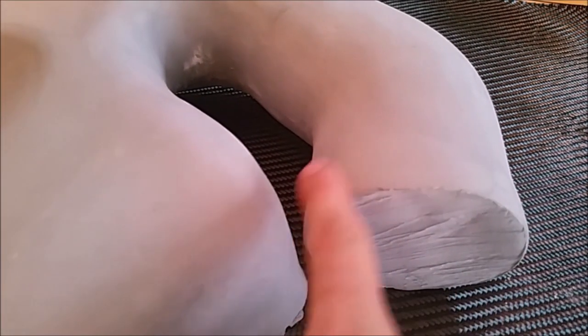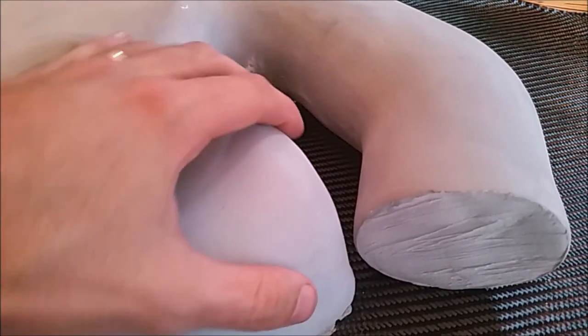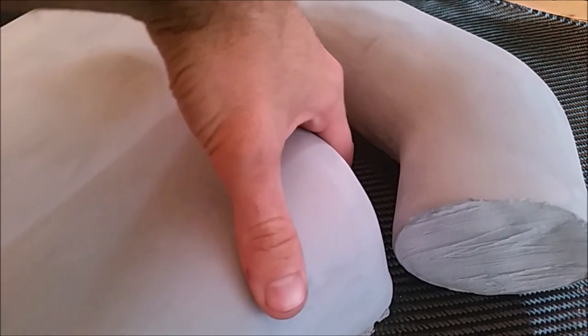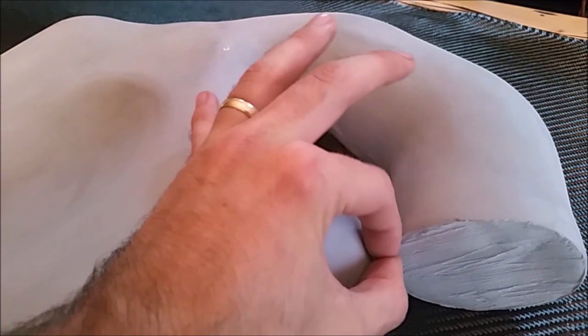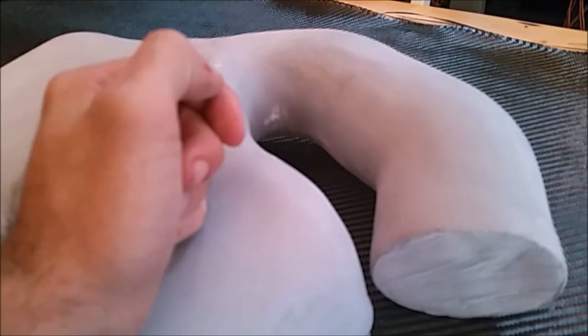I'm also concerned with making sure I get good, clean lines under the neck here so that this can seal to the lower plenum and has a nice, smooth transition. I also need to make sure that this section of the neck is extremely strong because that's what the throttle body will be mounting to. I need to get a lot of extra vacuum bag in here so it can pull into this gap, hold the back of the plenum tight, press down our mounting surface, not bond these two surfaces together, and then give us a nice mounting point to the throttle body.